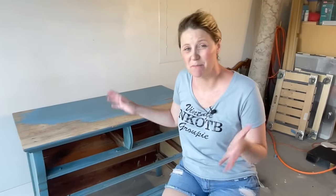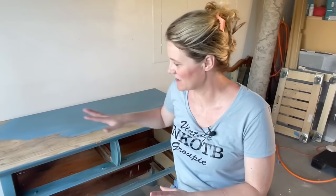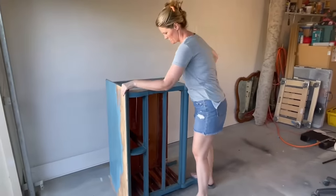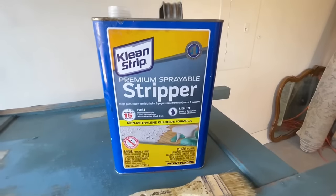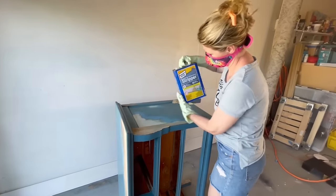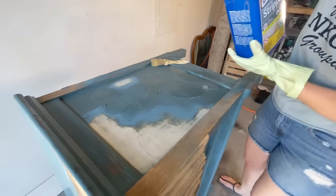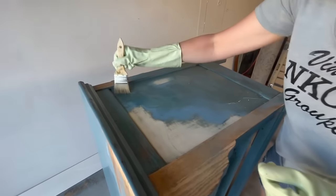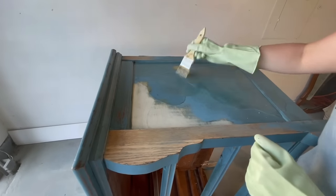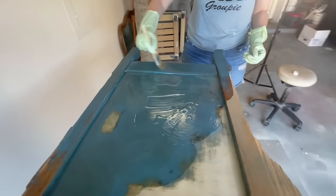Since I'm trying to restore this piece to as much of the original finish as I can, I'm going to use some chemical stripper. I've got a little more than half left on the top that needs to come off, and then the entire front and both sides are going to need to be stripped. I'll start out by using some Quick Strip chemical stripper — I've got my gloves and mask on; you don't want to get any of this on your skin. I'll apply it everywhere there is blue paint using a chip brush so I can just throw it away when I'm done. Once I have a liberal amount of stripper on the top, I'll cover it with some Saran Wrap to keep it moist — this dries out really quickly in my Texas heat, so if you live in a cooler climate you may not need to do this step.